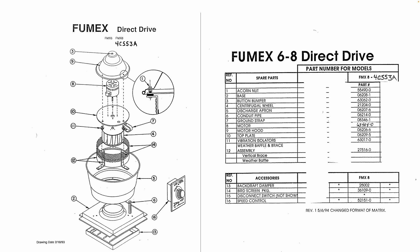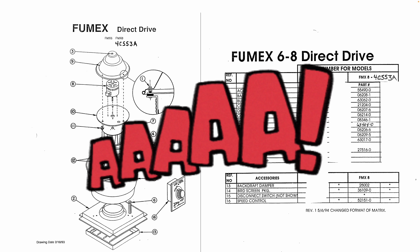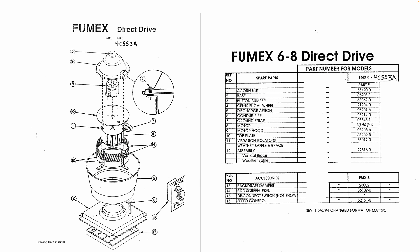I had to find a new motor because the motor part number on this breakdown was no longer available. Looking at the data plate specs of the old motor, I was able to find a new motor — it was also a Dayton. Keep that in mind: if you're working on an older exhaust fan, the original motor may not be available or discontinued, so you might have to source one with the exact same specs but a different, newer, updated part number.